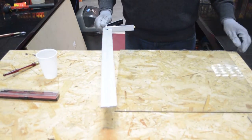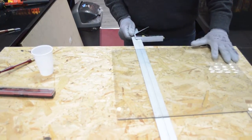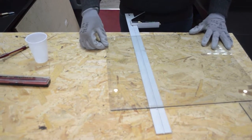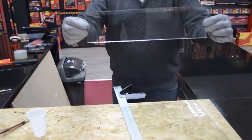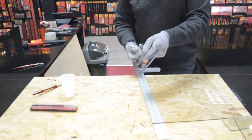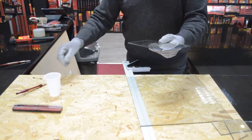All I'm going to do is lift the glass up, put the straight edge underneath it along where I scribed the line, and hopefully with a bit of downward pressure I've cut the piece of glass. It should be as straightforward as that. This is actually quite thick — this is 4mm float glass.